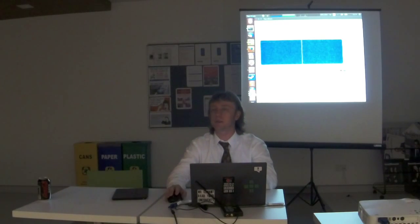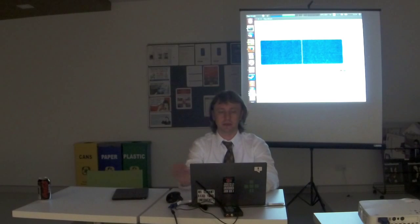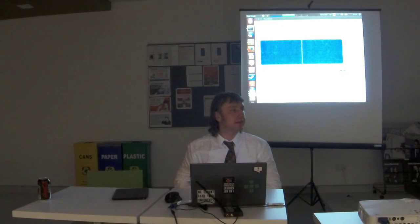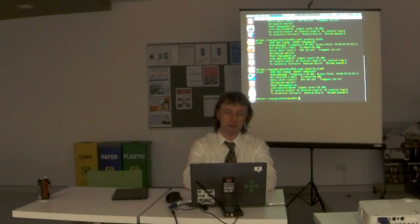At this gain level, it will not just see that there's a signal. You're working with a 20 megahertz wide slice. So it should cover the whole channel here. So here it's actually, this is 20. Oh, it's the width of the device. So this is at 5.28 gigahertz. So what I did, I started downloading something, and then I checked what is my band.